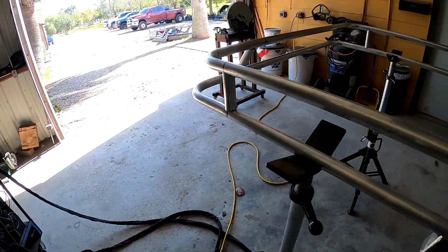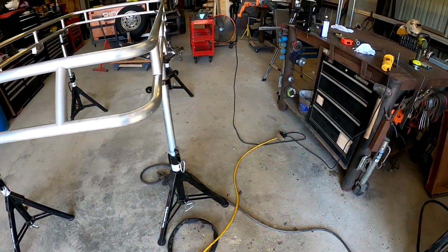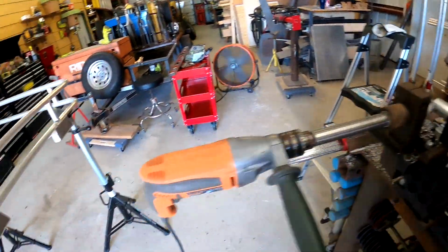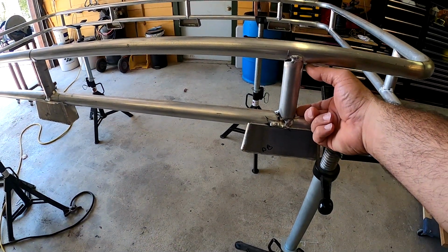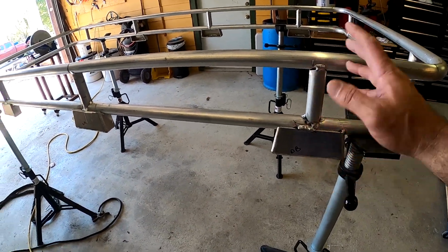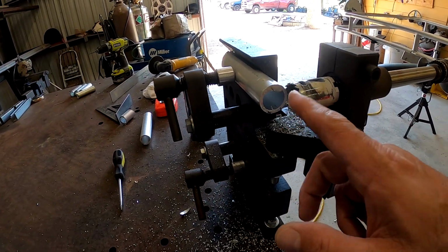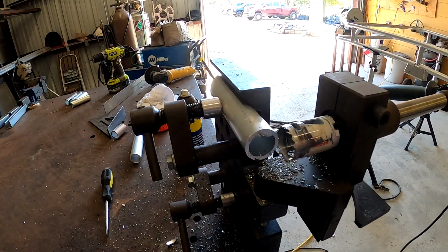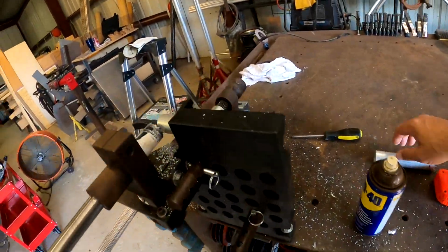Okay, I'm cutting these braces for the front and these last two on the side. But I just wanted to show y'all, whenever you go to notch, if I need a 4-inch piece from throat to throat, I always cut it 5 inches. So I got a 1/2 inch to cut off. It makes it easier on your hole saw if you're only cutting half out. And then you make your first cut about 1/4 inch in, 1/2 inch in, whatever. But it also depends on what pipe you're using, what size.